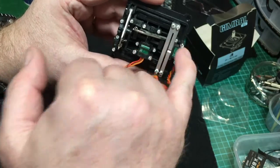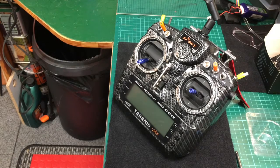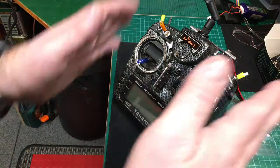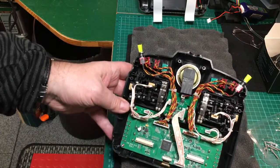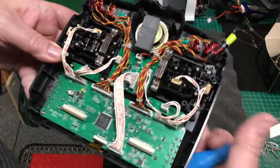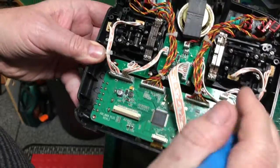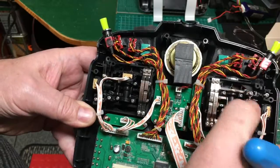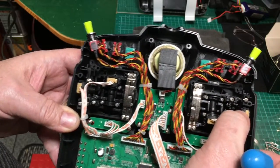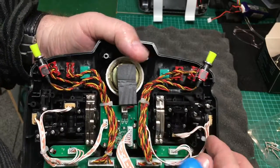The difference is with these they've got sensors called Hall sensors. Now I've got to strip it down — I'm going to use magic and there it is. As you can see, this is the gimbal mechanism, this is my throttle side. Those are the little potentiometers — there's a physical connection there, it's physically turned in the center of the potentiometer. As it moves it's moving the potentiometer, so these are all wearing parts.